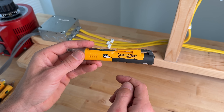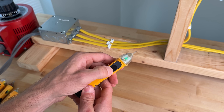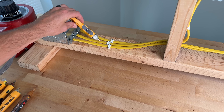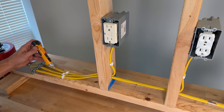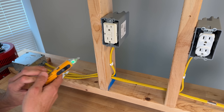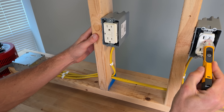The Ideal 61-627 has a voltage range from 50 to 1000 volts. A momentary press gives a green LED and audible alarm, and it has a two-level audible alarm. Test one — starts picking up from a distance away from the Romex. Test two passed, GFCI passed, and duplex passed.